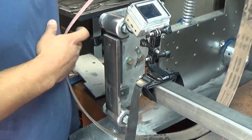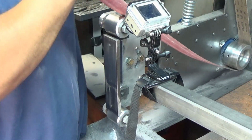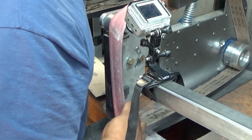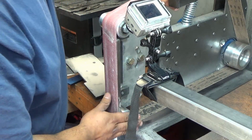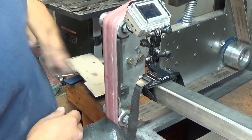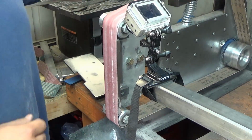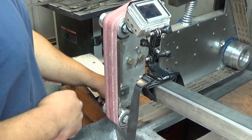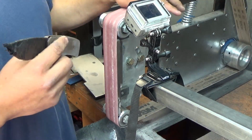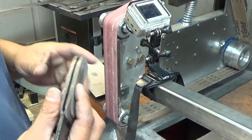You can really get nuts, and you could take this up to a 1,000 grit finish on the grinder, and then a 3,000 grit finish on hand sanding. So there is no limit of what you can do. But as a beginner, and I know you don't want to waste materials because you're going to be wasting enough steel and stuff as it is, we're just going to go low grits, kind of a raw finish, if you will.